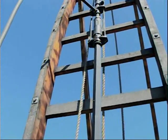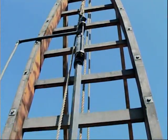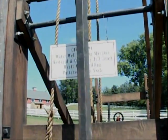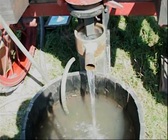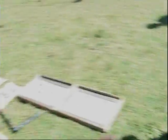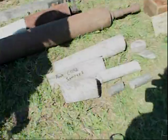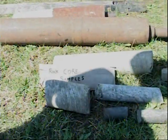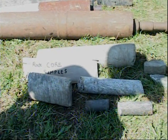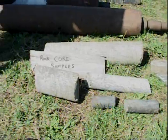That up there is a water swivel. That lets it rotate, plus you can put the water down through the center of it. As it was drilling, you'd let a little more weight down on it, give it a little spool, a little more rope off. You can see some of the rock core samples here that it took out of the ground when it was drilling. That's solid granite — this is solid granite — and it was taken out of Holmes, New York with this machine. And this core here is a limestone core that I actually drilled with this machine, the bigger one.